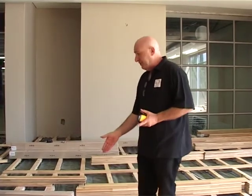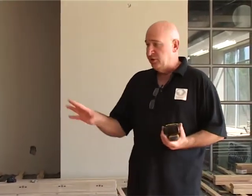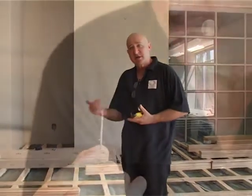It's also a nail down floor. Best for sports floors is nail downs on battens. You can also do sports floors on other systems where there's elastic mats or where there's spongy mats, but generally the wooden floors are done with battens, the old-fashioned way of nail down. Right, so now we're going to show you a little bit about what's happening on the installation, a little bit of a closer view. So let's go and have a look.